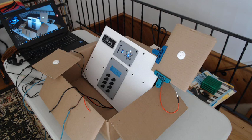Not a lot, really. We have a good ground. We have the two antennas hooked up right. Don't have a lot of metal near it or anything like that. The pitch plate coil and the plate are oscillating up at the upper end of the AM broadcast band. The volume plate coil are actually down at the lower end of the AM broadcast band. And I suspect this is probably upper end RF interfering, I guess.